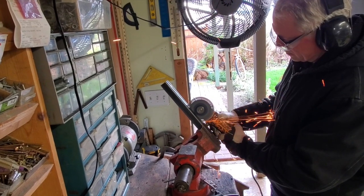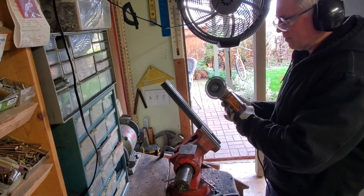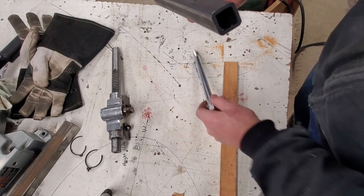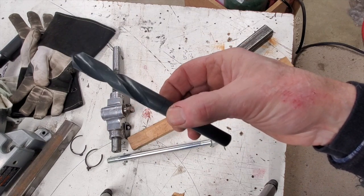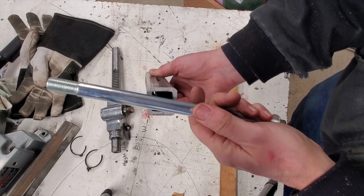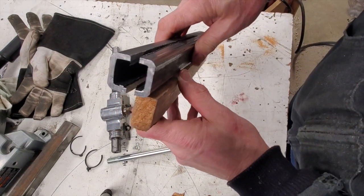This next part covers the tedious task of creating the axle assembly that attaches to the kingpin. I was hoping to find three-quarter by one-and-a-half inch rectangular tubing, three-sixteenths thick, but couldn't find any so I had to fabricate my own. I'll be cutting this section down, putting a plate across, and passing the axle through like so. I ordered a 15 millimeter drill bit off Amazon — a couple bucks, came the next day — and that'll be used to drill holes in the metal for the axle. I'll be cutting the head off the bolt, saving the threads, and welding it in to make a solid axle.